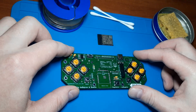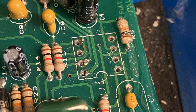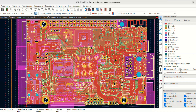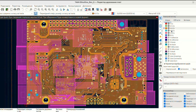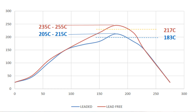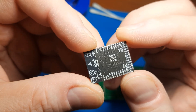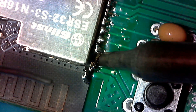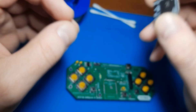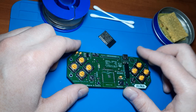A few words about why this happens. This is actually not a rare outcome when replacing connectors, large ICs, or even basic capacitors. This is because modern boards are often multilayer and full of massive, heat-hungry copper polygons. Traces, on the other hand, are very thin. And the eco-friendly lead-free solder melts with difficulty and at much higher temperatures than the good old 60/40. Plus, panic often plays a role — something isn't working, the device won't turn on, so you heat everything with the hot air gun and pull it off quickly because something smells like melted plastic. I know — I've been there.